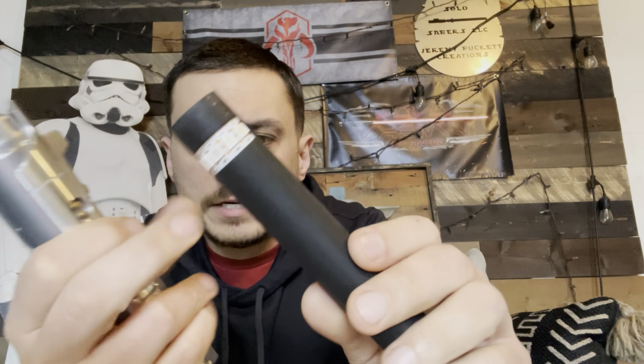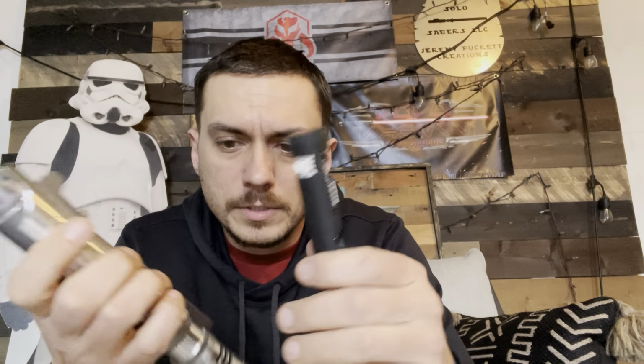So this has a removable chassis, and it uses the Smugglers Outpost switch PCB set. So your 14 pins are in there, and those never move. And then of course you got your other set right here that's actually in your chassis. I ran a strip of 4 pixels right here in your chassis so that I could light this mesh up, and they're wired in line with your blade. So they'll mimic whatever your blade does, whatever the color or the animation of your blade. These guys will set that off in this mesh as well.